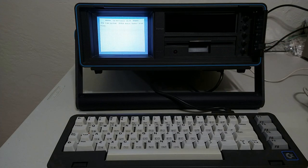The floppy drive now loads just fine and it passed most tests, but I noticed on the speed test it's running about 8 RPM too slow. It also seems to have a problem with fast loaders with copy protection like Vorpal and others. Part of that's due to the SX-64 being kind of notorious for having issues with the floppy drive being so close to a CRT inside the case. There's no shielding on the floppy cables inside that case right next to the CRT. I've got some ideas on how to try to address that, and I may do that in the near future.